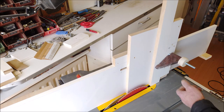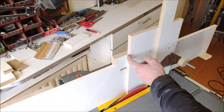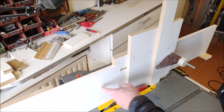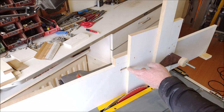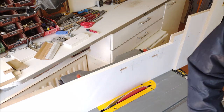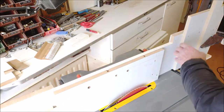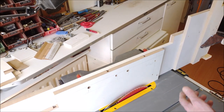When you do the large panels and have to do the short side, you get the extra back plate of the jig plus the wider panels going straight to the re-saw fence. These smaller pieces need to be included in the jig with an extra back plate. A good idea is to start with bigger panels by including an extra panel — you put an extra panel instead of the jig back plate, bolt or screw it in. When you then use the tenon jig, you take this one off and you don't have to reset your fence.